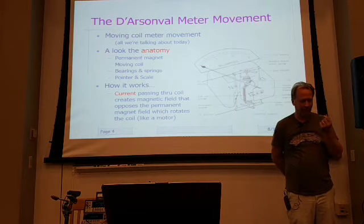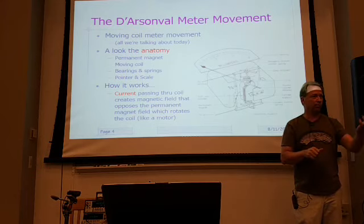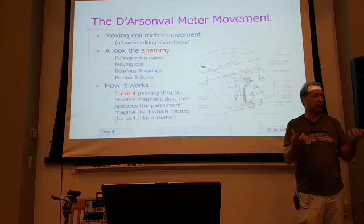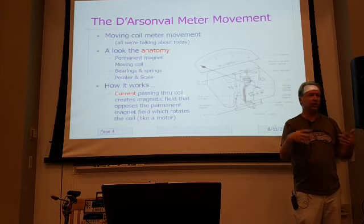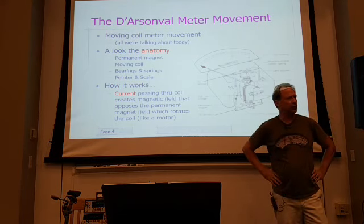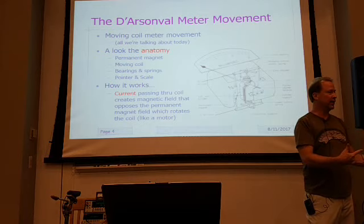It's funny, because I did a video about a year and a half ago on transistor current sources and how they can be used as high impedance loads in circuits and amplifiers. And I actually forgot to take into account the loading of the meter. I had a bunch of meters measuring various parameters of this current source, and one of the things I was trying to measure was the output impedance. I was using a Simpson 260 to measure the terminal voltage, and I just didn't think about the loading I was doing. It wasn't until after I had posted the video that I noticed the output impedance was a lot lower than I thought it would be. Then I thought, oh, dummy, I used the analog multimeter, and that load resistance was in parallel with a very high impedance current source. So I quickly posted a video the next day: did anybody catch my mistake in my previous video? This is what I did, and here's what it was.